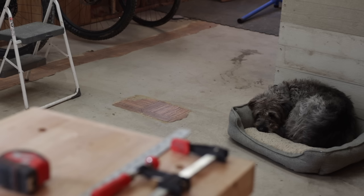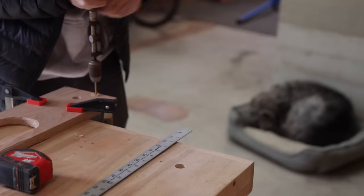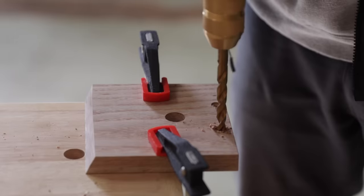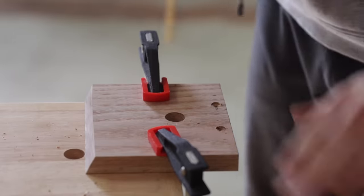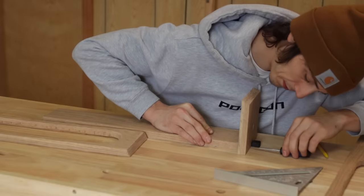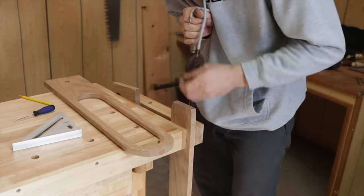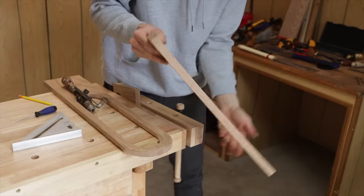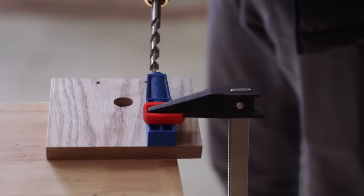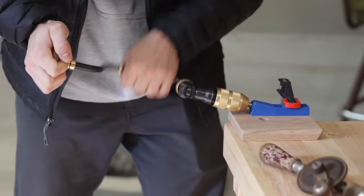If you did this by hand, you'll need to pre-drill for the back bracing and countersink those holes so your screws aren't sticking up. Make sure to pre-drill through to the back brace as well, which you can do by pressing your screws through the holes you made or using a pick like I did. Both methods are going to require you to pre-drill some pocket holes on the underside of the top board and the underside of the front board. You can get the exact same jig I'm using here for 15 bucks at Home Depot.